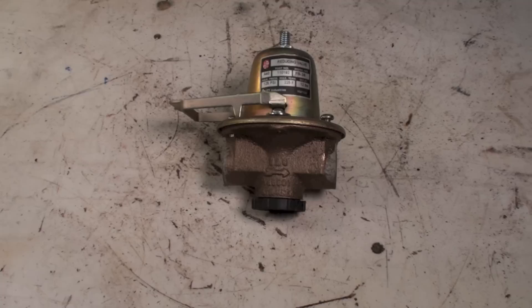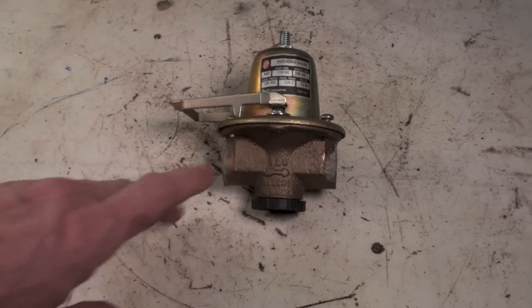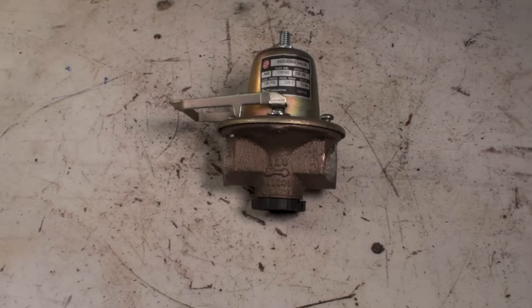When I say 12 pounds, that's if you have a boiler on the same level as the radiators or in a basement going up one floor. If you have a second floor you'll need to do 18 pounds. If you have a third floor you have a problem, because these boilers are maximum 30 pounds, and going up three floors you'd be at 26-27 pounds, which will start the relief valve weeping.